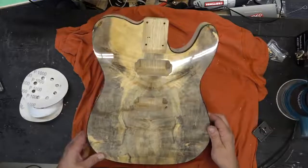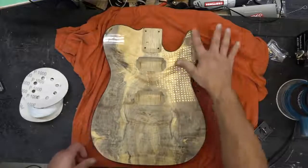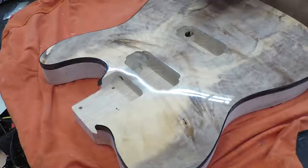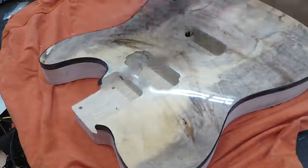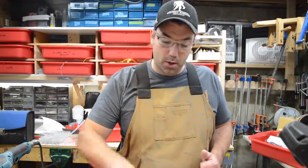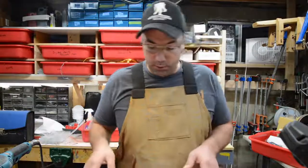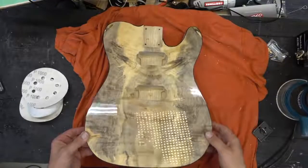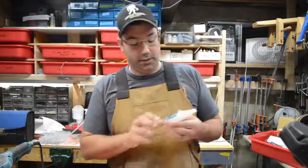I did not think that a super glue would be able to give you this type of finish and look. If I really wanted to just seal up the grain, I would have put the first coat on, sanded, and then put an oil. I usually don't like having burls with a gloss finish, but this looks outstanding. With the black binding, really gives it a neat look. This is fill and finish.